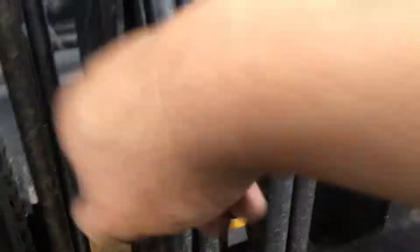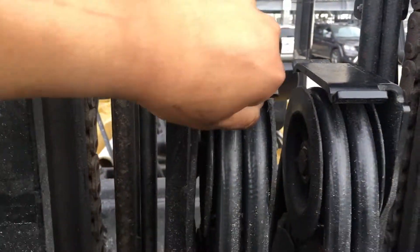When you look at forklift mast inspections, you want to look at these brackets for the hoses, because they can become loose. Over time they can fall off and cut hoses or bend the bracket — a whole lot of bad problems. Like this one — I can move this one around compared to the other one. All it is is just a three-quarter bolt, you can't really see it right here, but make that tight and then it should not move.